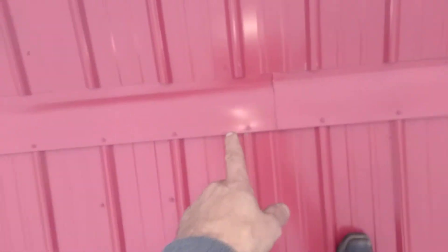This transition piece here would actually work, but this should be better screwed down — this screw's not holding anything. If you watch the metal it moves up and down. This should have been screwed to the transition about five inches up. The biggest concern is this sidewall, and when we get towards the left side of the porch we have the same thing on this side.